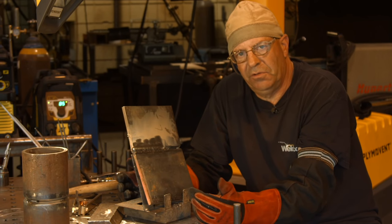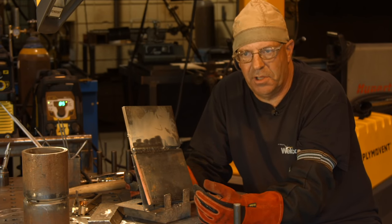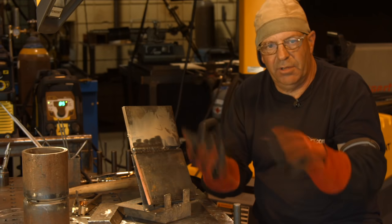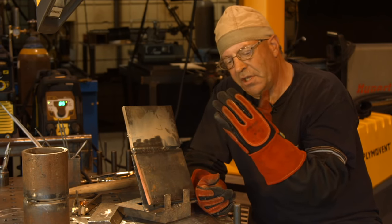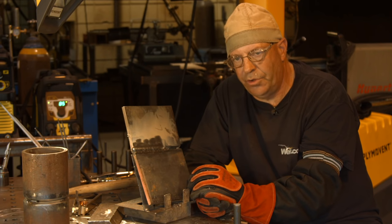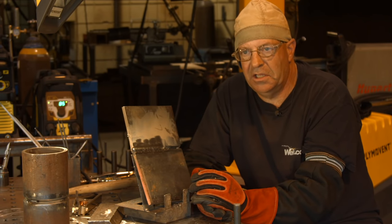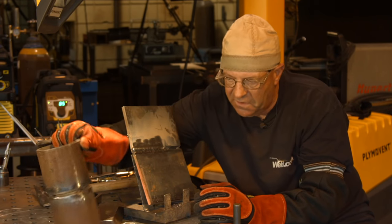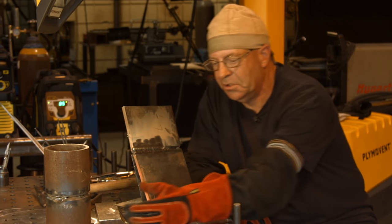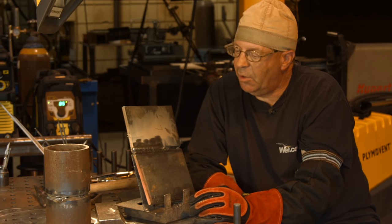I've seen some really good welders weld 5G and 2G. They have a little bit of trouble with 6G at first and then they get it. You put a 6G in front of them and they freak out. To me, they're easy - I feel comfortable. Something about the way I move around it. I've always taken my 6G tests where they're leaning away from you. Some of you have commented that you've got to lean it toward you. I've welded them toward me out in the field when you can't get into any other position, but all my 6G tests I've been allowed to do them leaning away. It's a 45 - I don't know that I've ever heard of a stipulation. I ask them, do you want it toward you or away from you? Anyway, I hope this helps out.